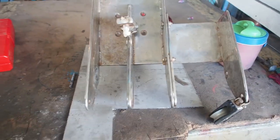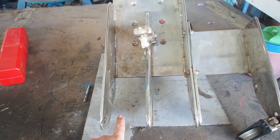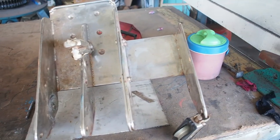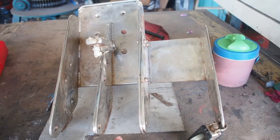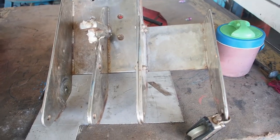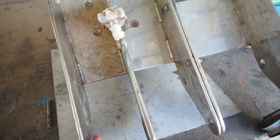So this is the bow itself, with the two bronze rollers — taking one from there, one from there. We're going to be using the end one as our actual bow roller mechanism. A previous owner retrofitted a third roller, presumably for a second anchor, because two anchors wouldn't fit there. So we'll just make a new nylon roller for these two. We had to customise it a little bit — had to grind away inside to allow space for the actual mechanism to fit.